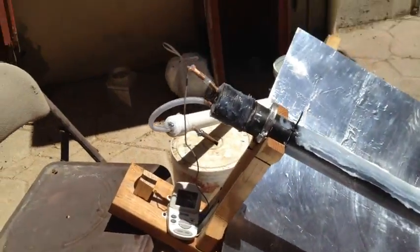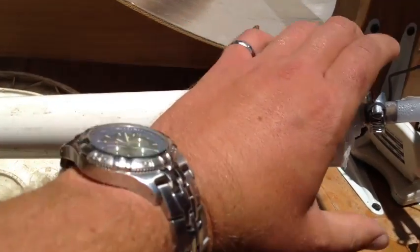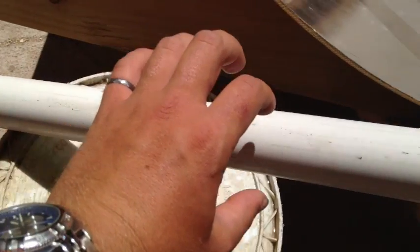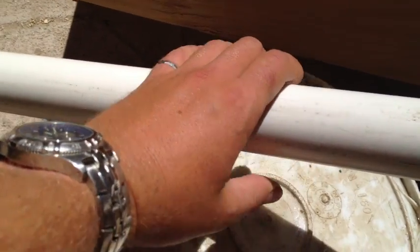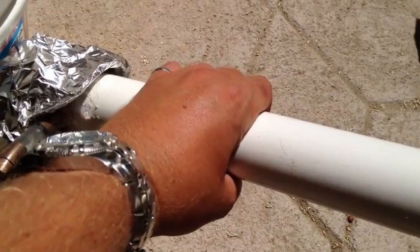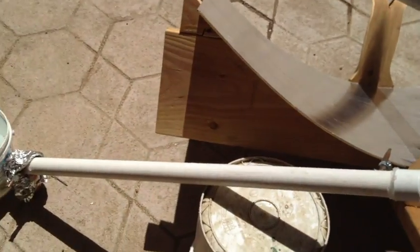It's running at 101 degrees and steam goes through here. The top of this tube is incredibly hot - it's hard to touch, especially right here. The hot steam comes in and it dissipates, gives all its energy off to the cold water that's around the center metal broomstick tube. As you go down the tube it's still pretty hot, but it gets cooler and the bottom's cool. When the whole tube is really hot, that means steam might escape without condensing. So we'll have to change the water - you just open the bottom, drain it out, and pump new water into the top.